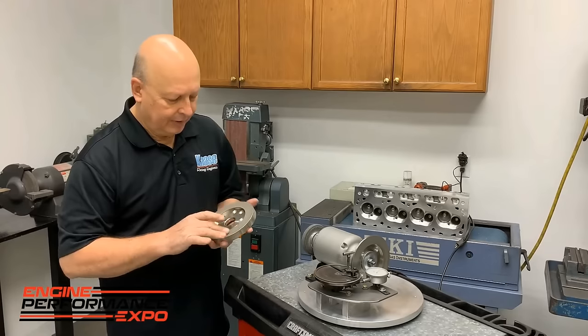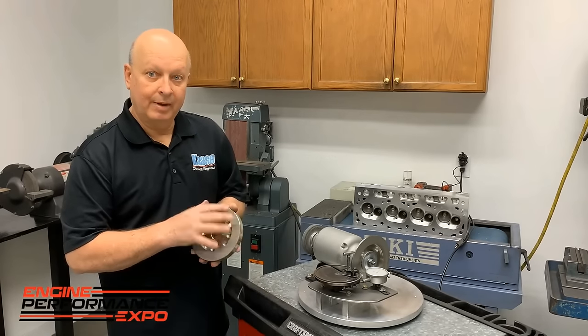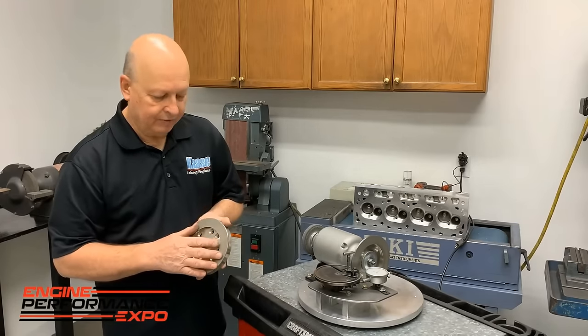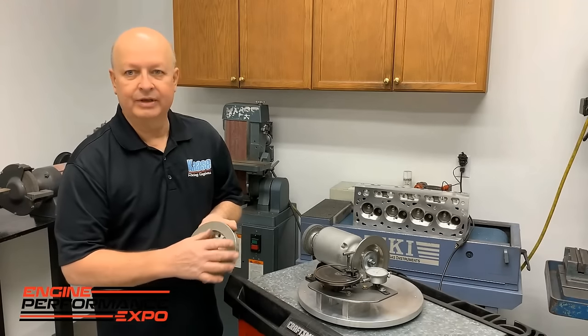They call it electroplated, but it's not like a vitrified diamond wheel where they're about an eighth inch thick, and we've had some stuff like that. We've had them on ring grinders before, but what happened is they end up getting grooves in them. You know, they wear out. And then you're always searching for a new place and you can't face them.